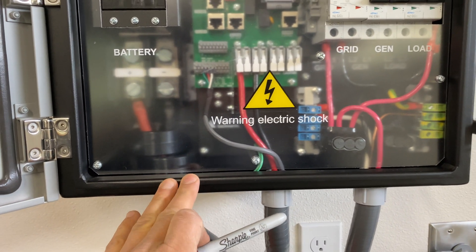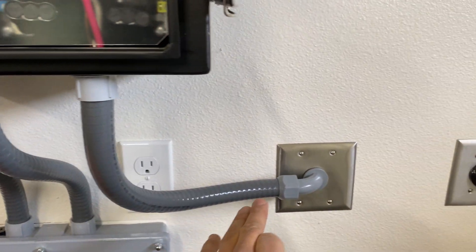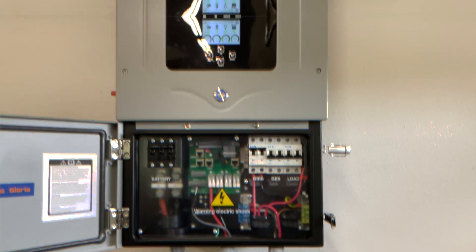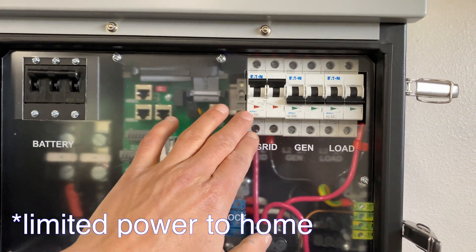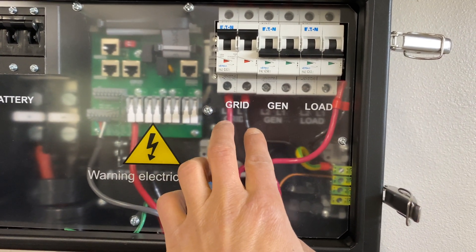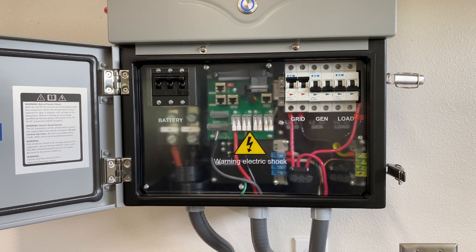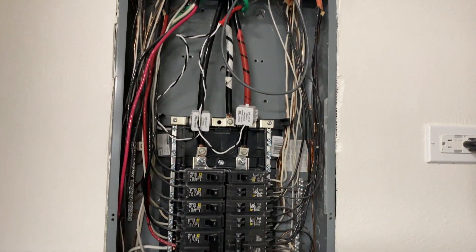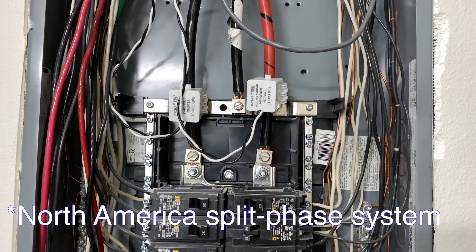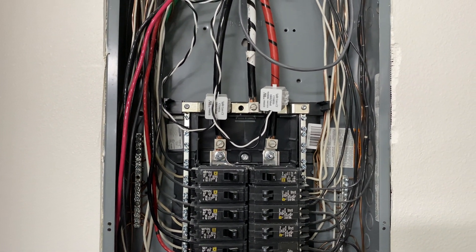In the middle conduit there are also four wires going to the sub-panel for CT sensors to measure house consumption. The right conduit has four wires — leg one, leg two, neutral, and ground — going to the sub-panel as well, in the same location as the CT sensors. The inverter currently works in grid-tie mode with a circuit breaker connected to the sub-panel wires. To switch to off-grid mode, those two wires reconnect to the load circuit breaker, the sub-panel is disconnected from the grid, and the inverter powers the house off-grid.